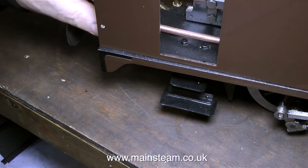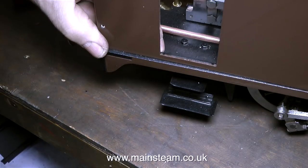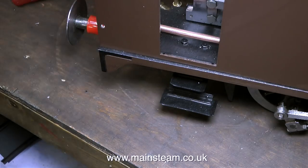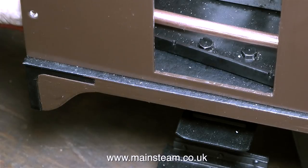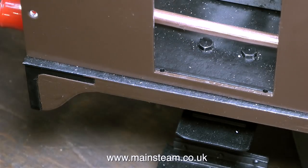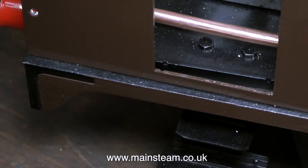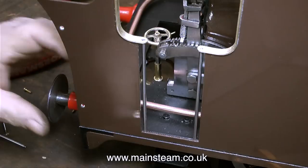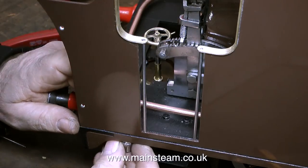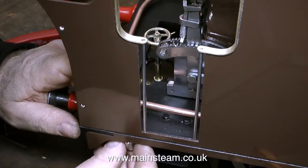When I built a seven-and-a-quarter inch gauge Titch locomotive many years ago — which I still have — I used what I think is a much simpler method for mounting handrails. I drilled some shallow holes in the brass half-round beading that are silver soldered around the window openings at each side of the cab, then drilled corresponding shallow holes in the running boards. The handrails didn't need machining at all; they just trapped between the half-round beading and the running boards and they've never fallen out.